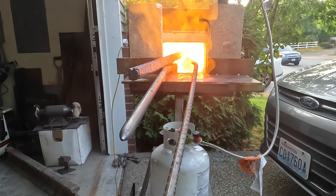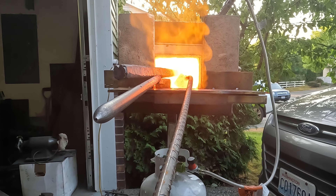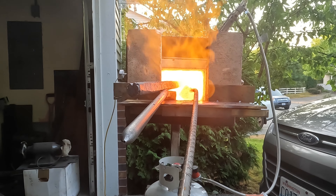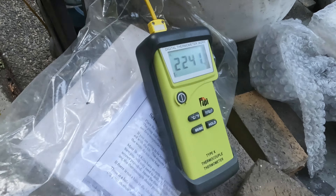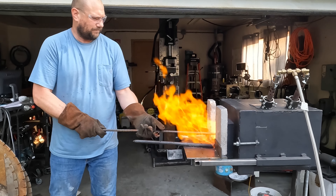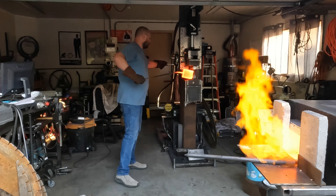Here it is in my little furnace. The forging temperature is quite a debate — some people say 2200, 2300, 2400. There's a decarburization that occurs in certain steels when you heat them above a certain point, so there's a danger in decarbing the steel. You see here I'm running at 2250 — right around there. My pyrometer is at a cold spot, so it's actually closer to 2300, but I forge at 2300 degrees Fahrenheit all day long.